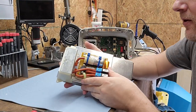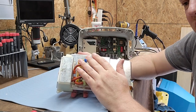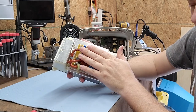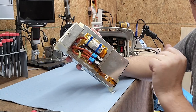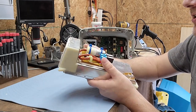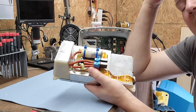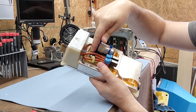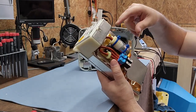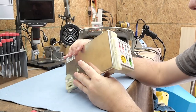Be careful when ordering replacement pumps — you can find them on other patient monitors; it's the exact same pump. If you ever have a cracked face or something, save the unit because the solenoids and this pump are probably still good. This pump is not a calibrated part — the voltage differential for your pressure sensor is what's calibrated. Two zip ties, clip clip, desolder two pins, take the hose off, and you can swap out that NIBP pump.